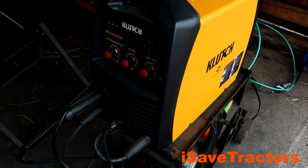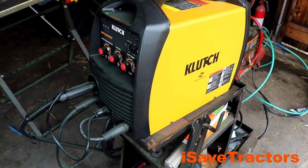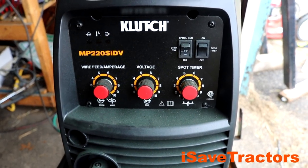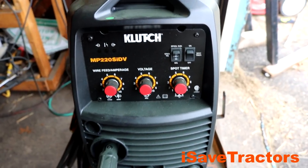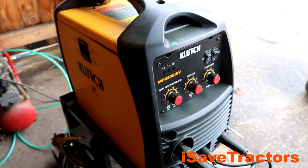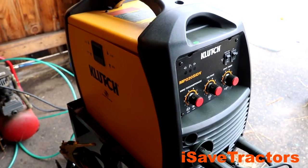One of the reasons for this project today is to test out this new welder I purchased back in December of 2017. It's been almost six months and I really haven't done any projects with it yet, so today that's going to change. This has a 200 amp output power limit. I'm going to be using a 35 thou flux core wire on three-eighths inch mild steel.